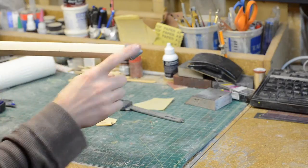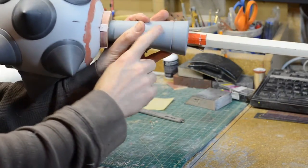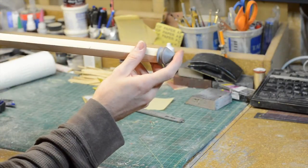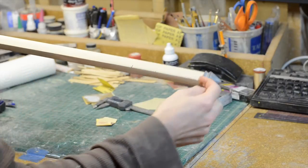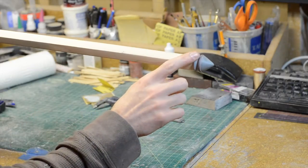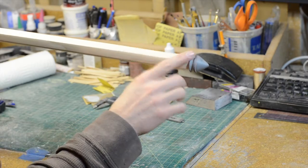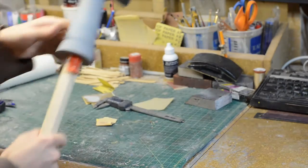The butt here — this pommel — I didn't videotape it, but it was lathed like I did this piece here, except obviously much tinier. I spun this around my lathe and it's just a hunk of plastic like the other one. Then I put a bolt in the middle of it and glued and screwed it down to the shaft. This overlap here will get ground down with a Dremel or something and then sanded flush, and then all the pieces weave together and I can start finishing this thing.